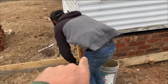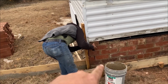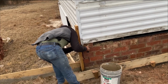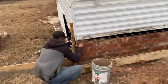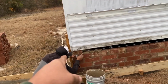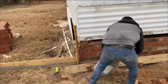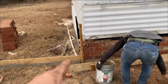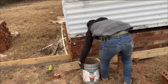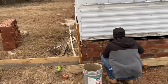That one there don't have mortar around it. Basically, it's going to slide out when everything else hardens up. We'll slide it out, and we'll slide that next one up out, or the second one up from that out, to make basically fingers that go over into that other side. So we'll put a 12-inch brick in there that'll stick out like 8 inches that way to hold that wall and this wall plumb. So basically it'll give you a right angle where it won't collapse as easy.